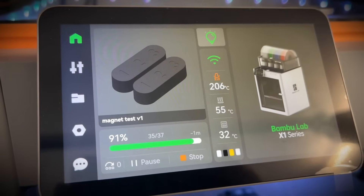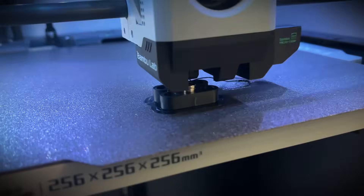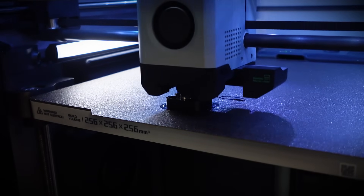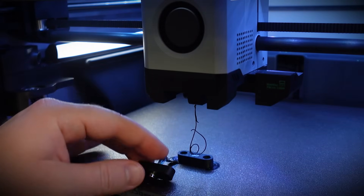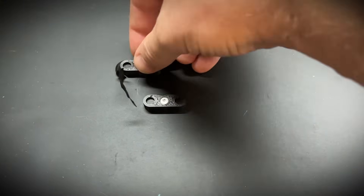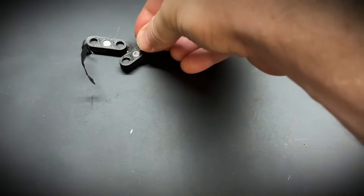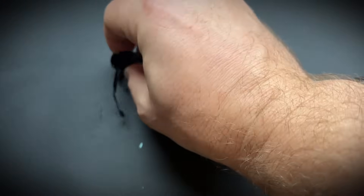Once the magnets are in place we hit resume and the nozzle will start heating back up. Once it's at the correct temperature it starts moving again — and straight away we've got an issue, so I quickly stopped. What happened is the magnets are attracted to the hot end and it skipped over the top, ending up moving over to the other magnet. Taking a closer look: the 6.1 I couldn't fit in, 6.2 I could, and 6.3 was the one where the magnets jumped out — you've got to be careful, they flick around quite a bit. The 6.2mm is pressed in and not coming out because the tolerance is really tight, but 6.3mm isn't tight enough and the magnet just drops out when the print head goes over the top.